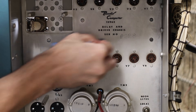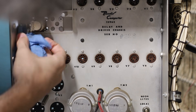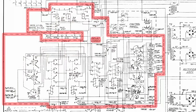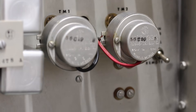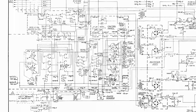Let's give the relay and driver chassis itself a proper wipe down. But what is this relay and driver chassis for? Looking at the power supply schematic, we can see it holds a bunch of relays. The power supply is fantastically complex, but the important thing is that it sequences power in a very specific order so you can bring things up in a sequential manner. All of that sequencing control is on the relay and driver chassis, and we can see the sequencers on the schematic as well as inside the machine. When we get to bringing up AC and DC, we'll dive very heavily into this.